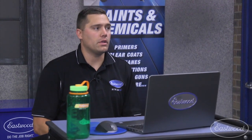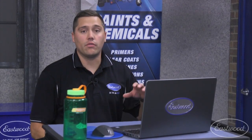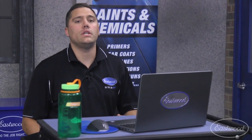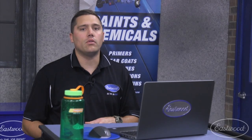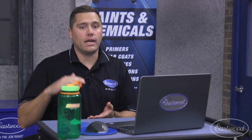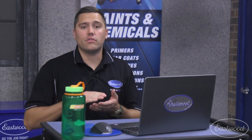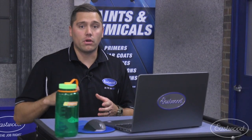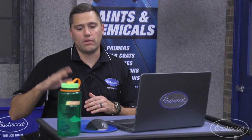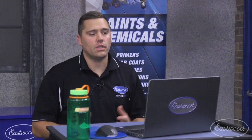Quick tech tip too. You talked about people getting confusion. Being that I came from the tech department, one of the calls we also got a lot about is the foot pedal. That remote amperage control is really nice, because if you want to change something on the fly, you don't have to get up and walk back to your machine. But something to take note of: if you're doing a lot of really thin metal, don't turn it to 200 amps, because you have a certain amount of play in the foot pedal that has to vary from 10 amps to whatever you have it turned up to. So if you're working with really thin metals, make sure you have it turned down. That way you have more adjustment per movement of the foot pedal. So it's not trying to vary from 10 to 200. It might be varying from 10 to 50 amps. Now you have a lot more play, making it a lot easier on those thinner metals to truly vary it. It is a variable foot pedal, so something to keep in mind.